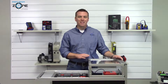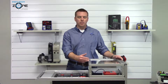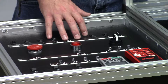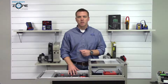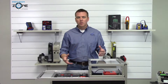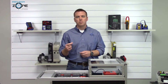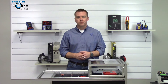This drive has passed all the tests that our cart can run on it, so now it is safe to put in its application. Make sure that you have put those parameters back into the digital operator if you changed them, and before you disconnect the drive from the power cart, make sure that the DC bus has been discharged so you don't get any accidental shocks. I hope this video was helpful — if you have any questions you can always find us at PrecisionZone.com, and if you need a custom-built solution to a problem you have, we would be more than happy to help. Thanks for watching.